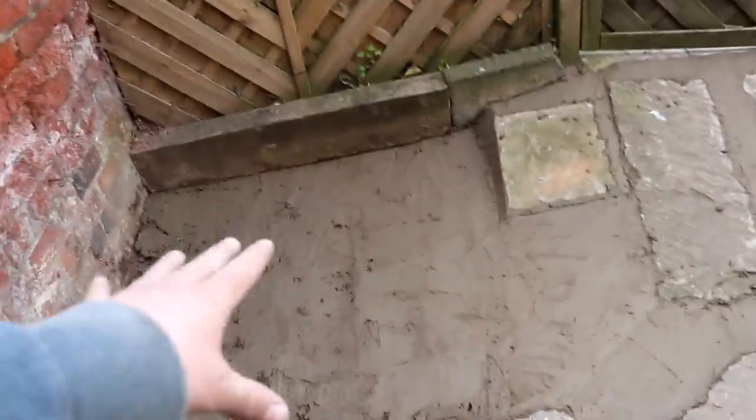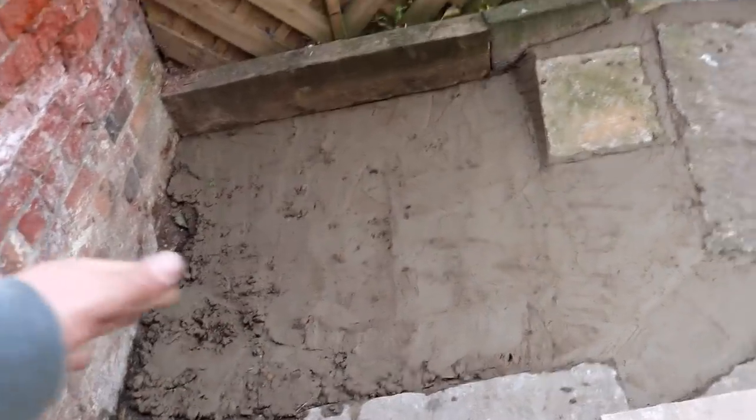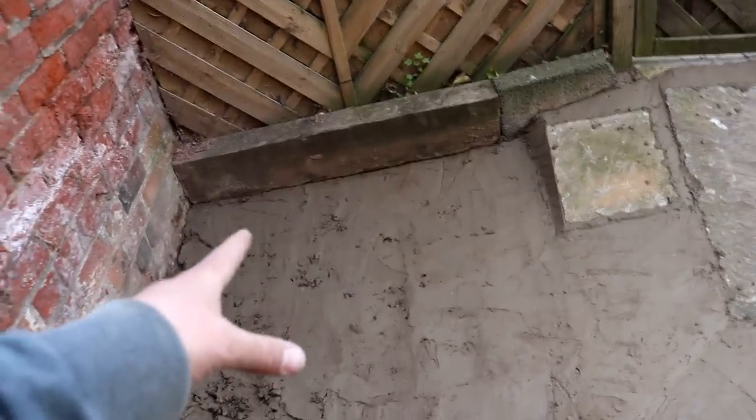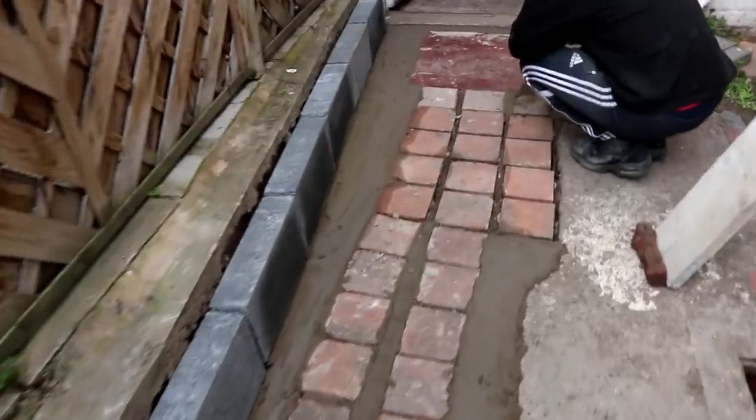Not today of course because we're covered in cement dust. What I managed to do is throw the remainder of the concrete mix down here to make a little bit of a pad — it's not finished, I'm going to come back and lay another layer with some shuttering so we've got a nice solid pad to put the bin on and any other empties. And then all this section here is now filled in and Jack's just doing the last little bit of pointing in between the quarry tiles.